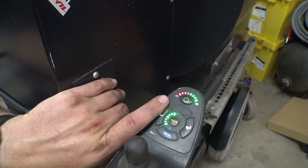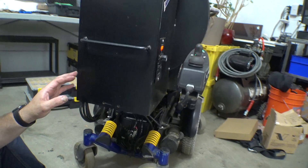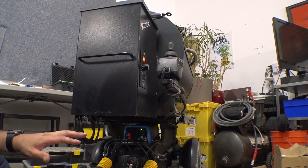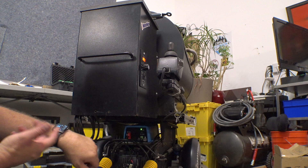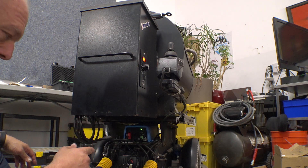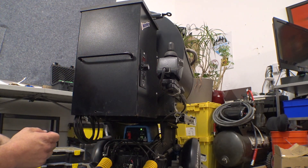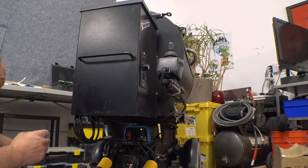I'm not sure if we can rely on this for battery level. I should probably add another battery gauge to this thing - the Dynamic Controls system has current sensing, but if power is leaving the system somewhere other than through the drive motors, it may not affect that gauge. So it probably wouldn't hurt to get an external gauge. All right - it seems to work. Let's go ahead and turn that off before it actually lights because we don't want to fill this place with smoke. Sweet.